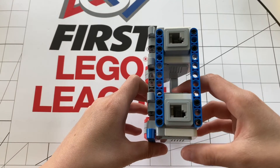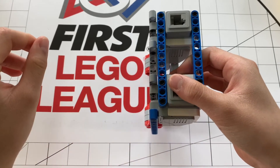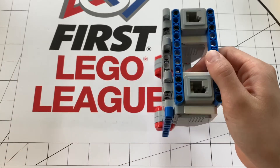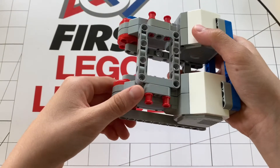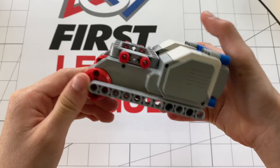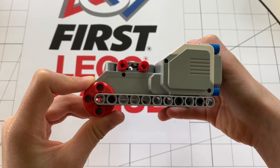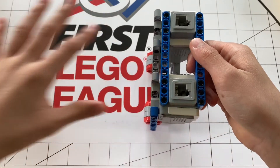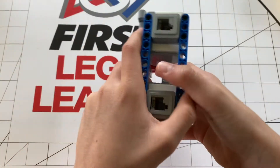And finally, let's look at the rarest and most unique alignment: the vertical alignment. I see a lot of teams use this, and what they will do is they will place a brick or another object here, and they will have the motors positioned like this or this. Another thing about this alignment that it also shares with the previous alignment is that depending on which way you arrange it, you will have to use negative power for your robot to move forward, and positive power for your robot to move backward. For example, if you have it aligned like this and you have your brick here, forward would be this way, but that would also be moving your robot back.